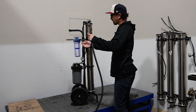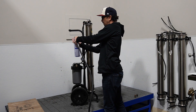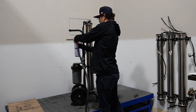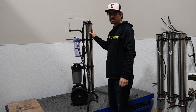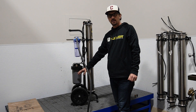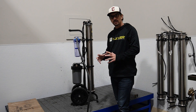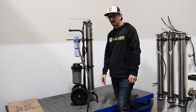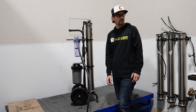The inlet to the cart is up here on your pre-filter. Simply connect your water supply. This pre-filter as well as the RO is installed out of the box from us. Your DI filter is in the box and you'll want to install that yourself. It's sealed in the package for freshness, so we don't install them right away because we never know when you're going to get it and when you'll utilize it.